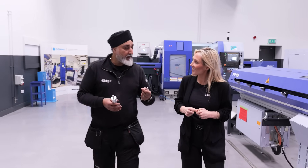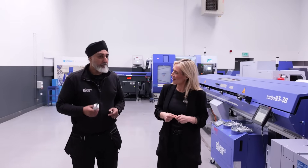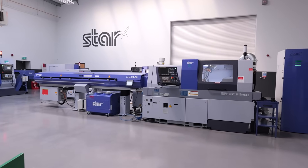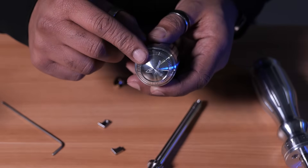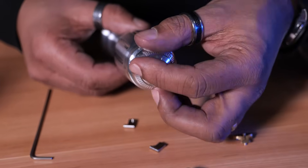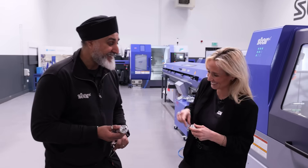All the small parts were made on the SB16, purely because they were small parts and we were picking up what they call prismatic parts — there was no turning on those parts at all. So we had to design a collet, manufacture the collet, put it on the machine, make the part and pick it up. This machine also created the spindle and the end cap, which looks like a clock face. I love how you've engraved the star into there as well — we have to leave our mark.